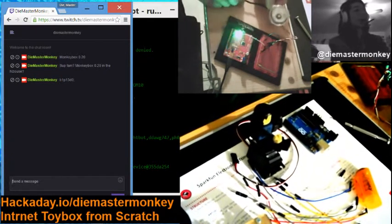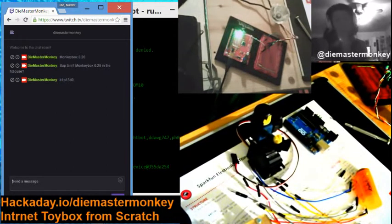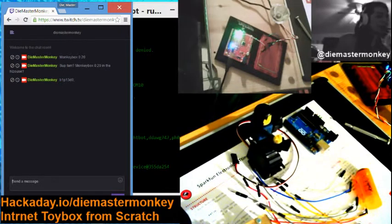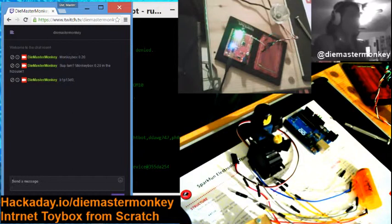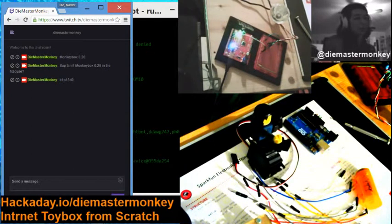And then, actually, I decided to move the wiring around just a little bit for convenience, and after I did that, I repeated that test just to make sure that I hadn't screwed up anything that was correct before. So now I know that it works, and that if it receives high on that pin, I've plugged it into Arduino pin 8, I know that it will turn on. At least it should, if everything's working the way that we've observed so far.